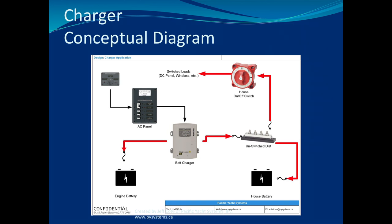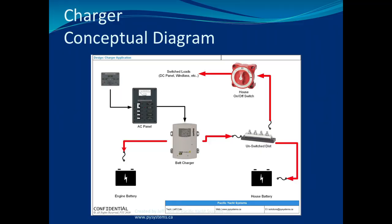So what you want to do is turn the breaker off, turn the breaker on, see a change. Are the lights lighting up on the charger? There's always some sort of indicator light on a battery charger. There's always something saying this is on. Either the needle's going to go up, or there's going to be a bunch of bulbs or LEDs that light up. Something is going to tell you that this thing is energized. And if you're turning the breaker on and off and it always looks dead, then you know that either the device has failed or the breaker that feeds this device has failed. And most likely, breakers rarely fail. If you've got AC power at the panel, you turn on the breaker, that little LED light turns on, and then you don't have power here and this thing doesn't light up, it's dead.